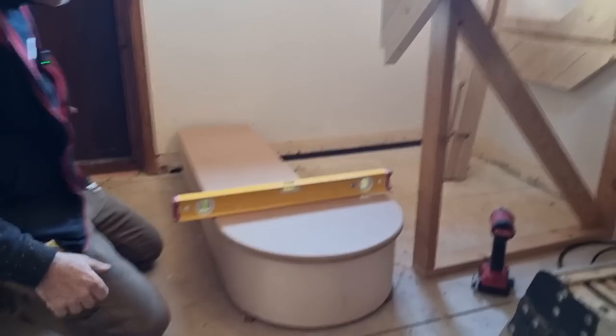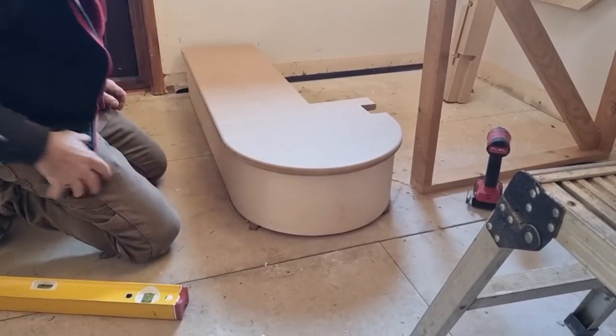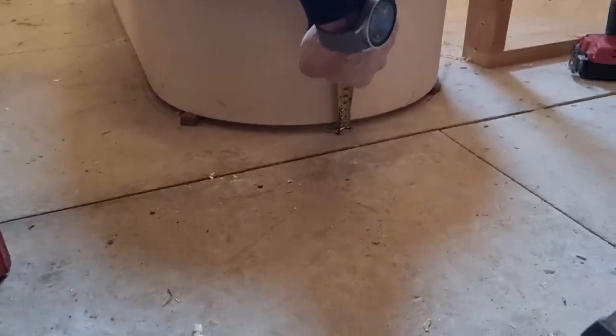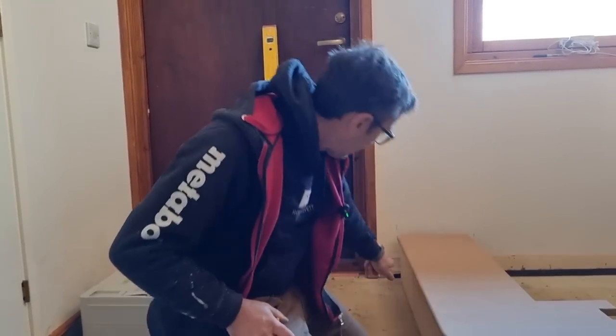Then what we've got to do is take, this is the distance we've got to shoot it in. That's the sort of deepest point, if you like. And we want to take that down. So whatever that is there, it's around about 10 millimeters. We need to scribe that all the way off there. So it's from nothing up to 10.